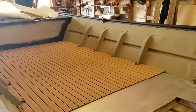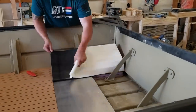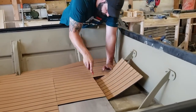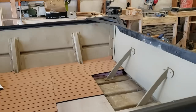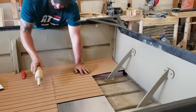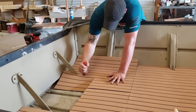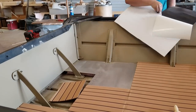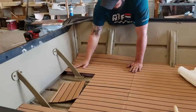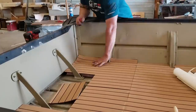Another tip: it's very hard to get large pieces stuck down by yourself. The easiest way is to score the backing material covering the pressure-sensitive adhesive and only peel off small sections at a time. If you try to stick down a big piece all at once, it won't be straight or you'll get an air bubble. Cut a small section of backing, get it lined up, then slowly work your way toward the other edge. This adhesive is pressure sensitive — if you barely stick it down without pressure, you can still reposition it. But as soon as you step on it or push it down, it's stuck for good.